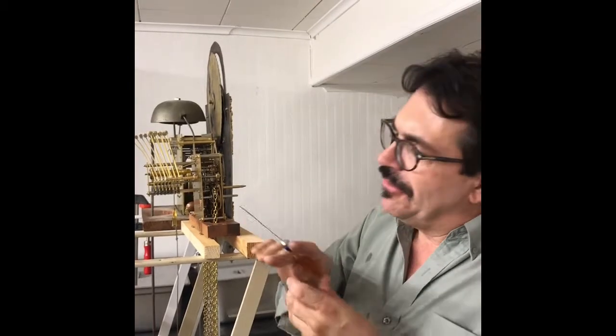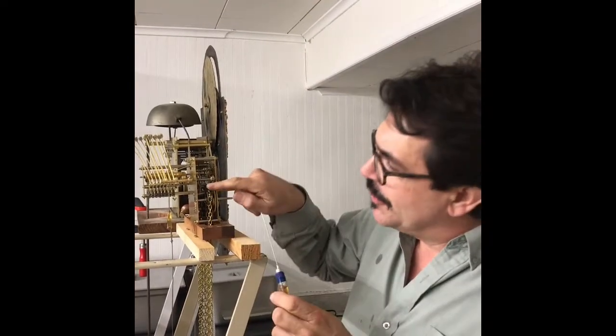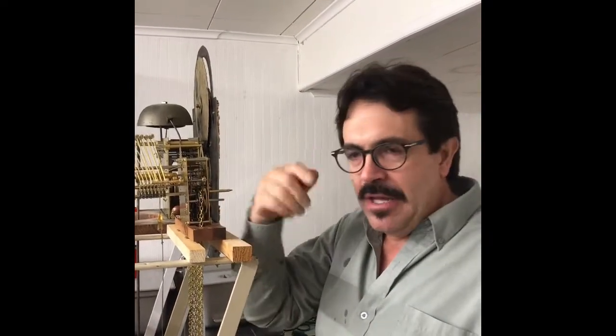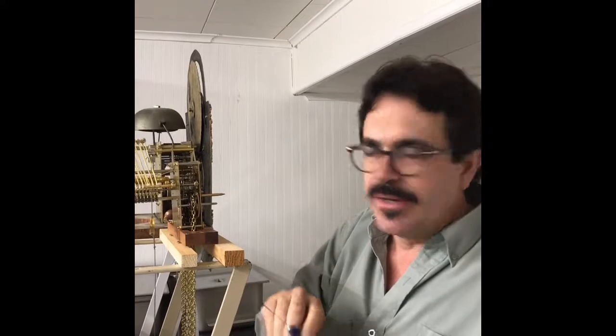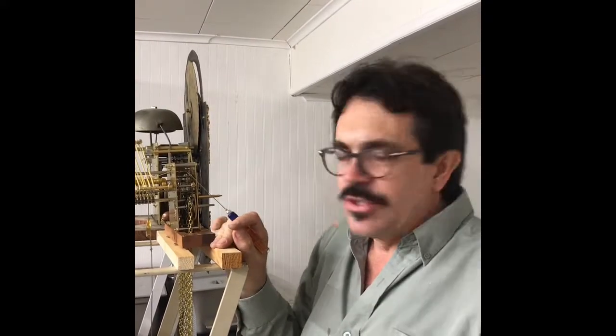If you can imagine your finger and you're putting oil on the tip of your finger, if it's going through the plate, it's a polymer that wraps itself around, and literally it's almost like your finger, if it was in the hole of the plate, turning on ball bearings. But nevertheless, there's still some amount of friction. So the arbor or the axle is out of steel. The plates are out of brass, so the steel wins in essence.